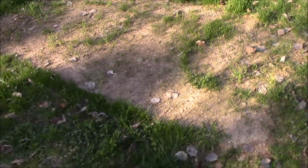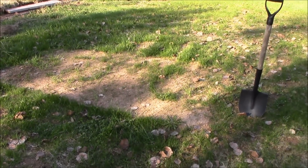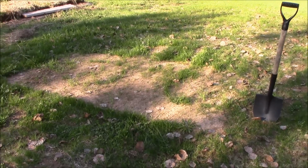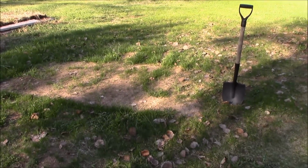A lot of people mark the openings to their septic tank with a little lantern or whatnot, but the problem here is you don't need to get into the big round opening. You need to get into the first opening that allows stuff to come through. So I'm going to have to dig it up, but make sure you always have it marked. If you're going to live out in the country, you need to know how to deal with this stuff.